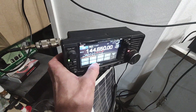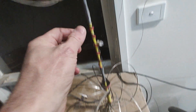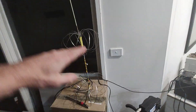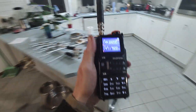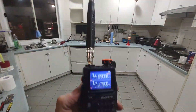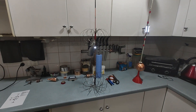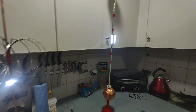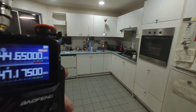So that's a quick rundown. I'm going to shut down the IC705 and grab a little handy talkie. While I'm doing that - this is the original one, but it was a bit more complicated with a lot more inductance and bifilar pancake coils. Although it is physically shorter, it wasn't adjustable, that's why I'm showing you the other one. So we're on the same frequency now, and this is just running its max power which I think is 10 watts. You could hear it coming through the other radio - VK3 VKE testing on the frequency. You can see that's lighting up also.